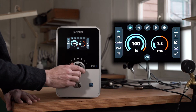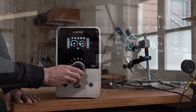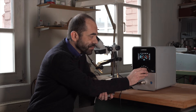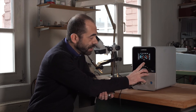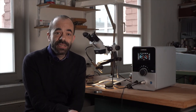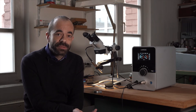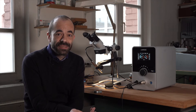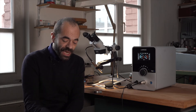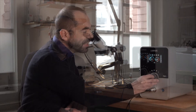If you turn the knob faster you can set the higher numbers more quickly and easily. With the speed mode, the speed can be set in three different levels: low, medium, and high. The highest speed is especially helpful for materials with high heat conductivity like silver, and even difficult materials like aluminium and copper are much better to process with high speed settings and high energy going into the workpiece.